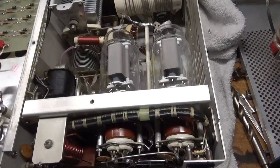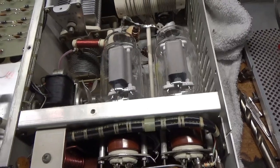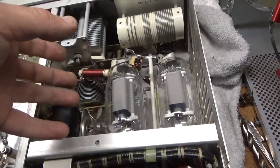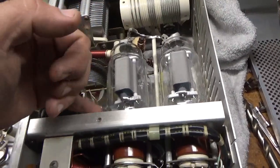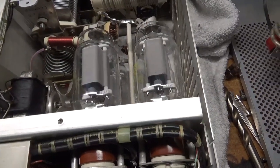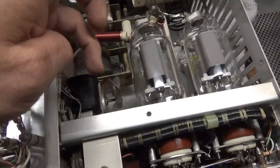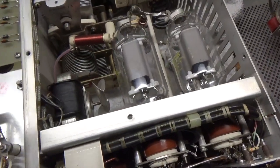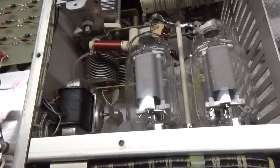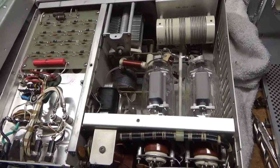Those are installed. It's best to remove the tubes — the bottom tubes — with the bottom cover off. Don't try to remove them from the top; just take the bottom cover off, remove them, and then install them. With the 572s, you have to go in at a slight angle to get the pin past the chassis, but they will go in. That top one has to be notched — that hole has to be notched just a hair for the pin to fit, because you can't go sideways because of the air variable. Thanks for watching — AmpRepairGuy.com, 203-892-4119.